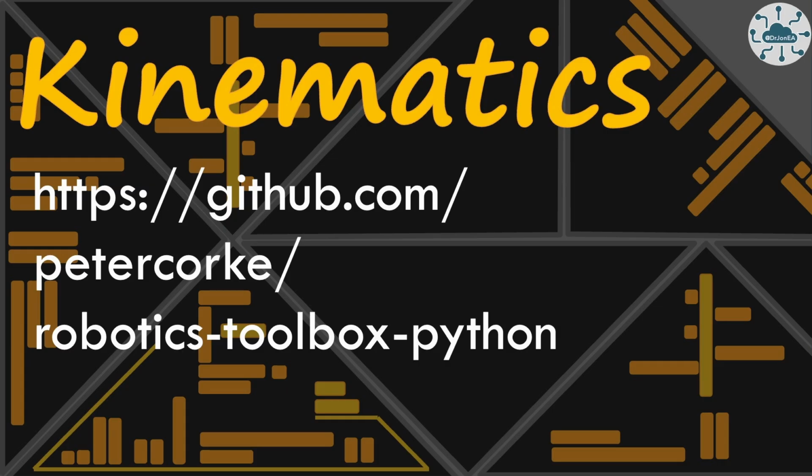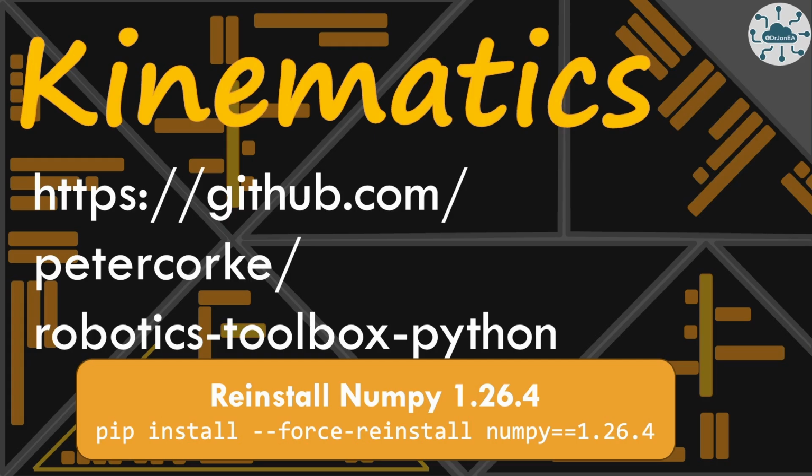To do that, I'm going to use an excellent library called the Robotics Toolbox, which is brilliant, but there is a slight incompatibility going on. You see, the Robotics Toolbox is going to use an older version of NumPy, whereas OpenCV wants the most recent series of versions of NumPy. So for this example, I seem to manage to get away with reversing NumPy back to an older version, version 1.26.4. So I suggest using pip to do a force reinstall to take it back, because that will allow you to work with this Robotics Toolbox, and for the moment OpenCV seems to be okay and happy with that.